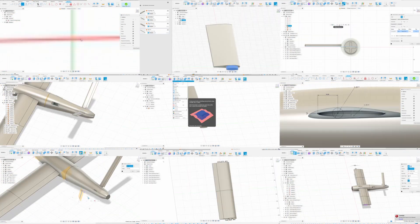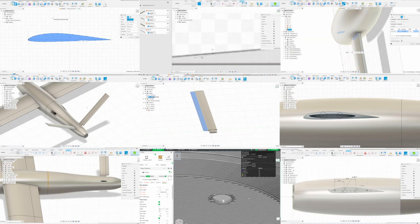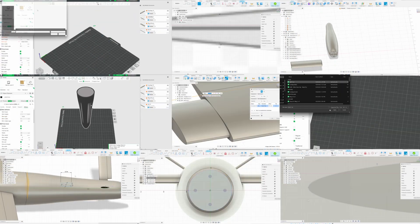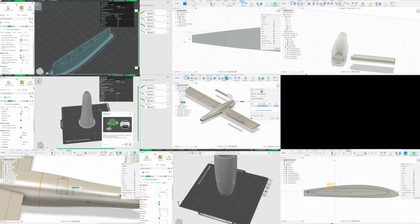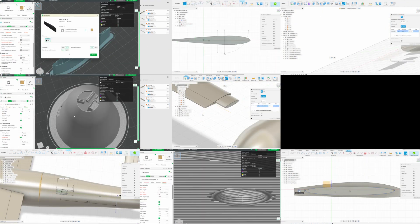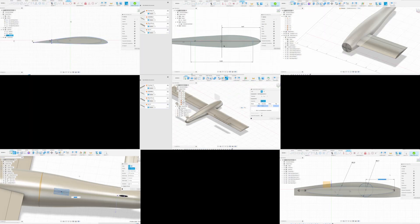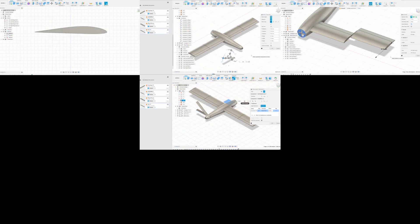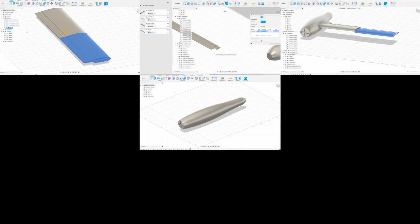I placed the wing toward the top of the fuselage so that it would have less tendency to rotate. The fuselage is the main body of the airplane that you slap all the other pieces onto. I made some spots for mounting all the motors. And for the tail, I plan to have elevators and a rudder, but then I figured out about these things called ruddervators — it's like a combination between the two, and that sounds way easier, so that's what I went with.